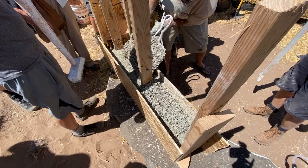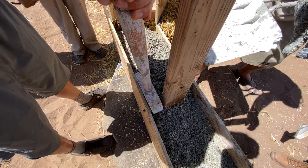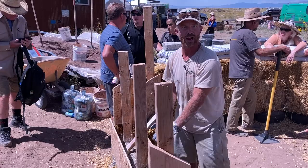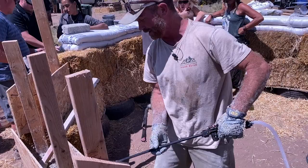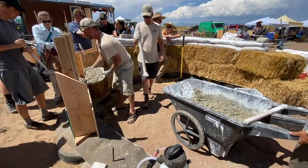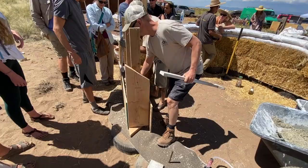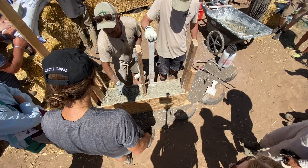Make sure you get under that nail, because there can be a big gap underneath if you don't pay attention to the little corners. Press a little extra tight in the corners because you want them nice, clean, and holding together well. You can also massage the forms — hit it with a reciprocating saw, which helps out a lot too. Overnight or after a lunch break, the top layer will dry out a little bit, so you pick at it, bring it up, and wet it down to help it meld with the new batch. A lot of little taps is better than really hard ones. Leave the middle loose for insulation, but get the edges good and tight — it pulls the wall together better.